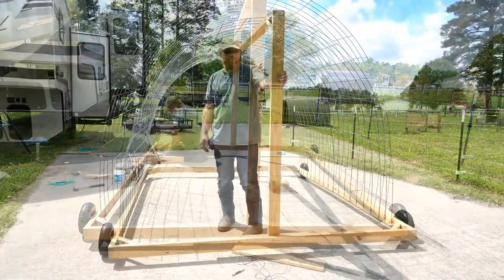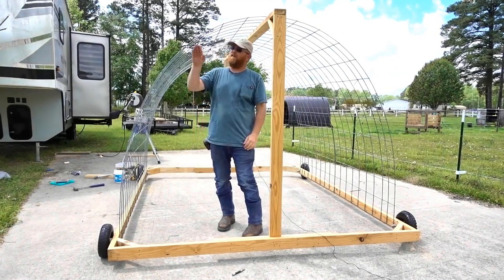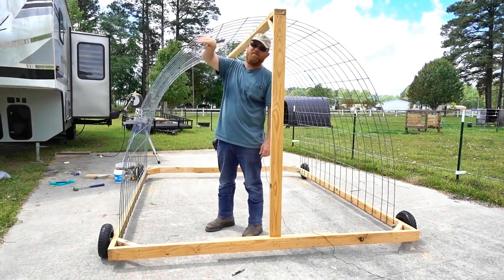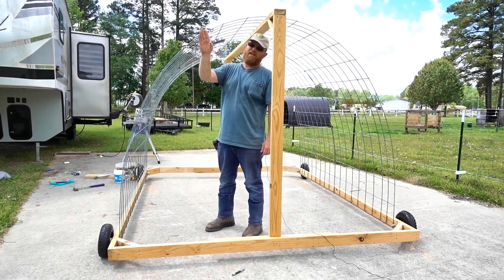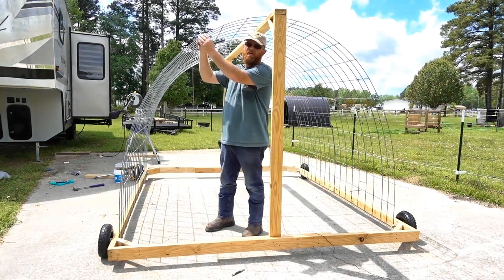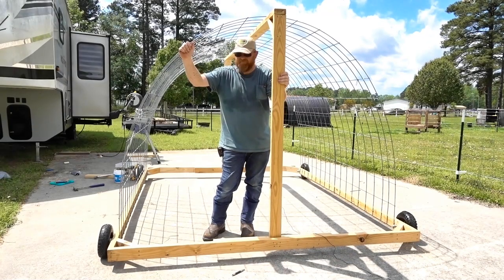In just over two hours, you have a mobile sheep shelter. Remember, this one's a little tall because we're going to make a mobile chicken coop out of it. One thing to note is I put these on wrong and I'm going to have to flip them — I didn't want to do it on camera. You want your long pieces to be on the outside and your short ones on the inside; less chance of tearing up tarps. You're always going to have to replace a tarp every year or two, but this will help prolong it if you've got the long stretch on the outside. So thank you for watching and have a good day.